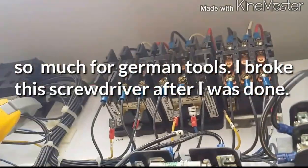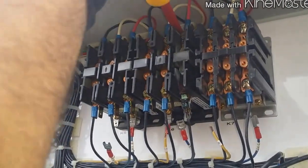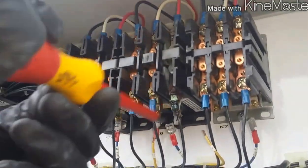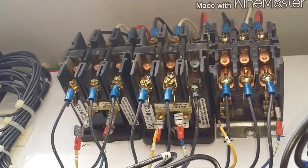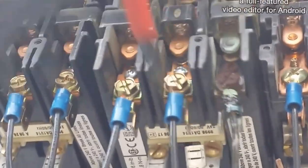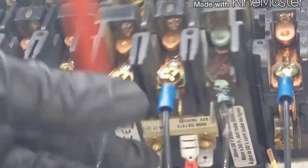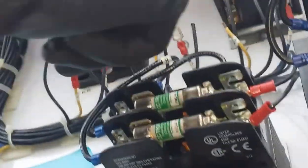I want to make sure everything's off — this is 460 voltage, man. I'm going to shut this off. You know, once I change the contactor I might as well change them for the whole unit. We're putting new fan motors in so they want everything fresh. I did a major repair on this chiller at the beginning of summer, so we're going to change all the contactors because they're old and this one is obviously bad. Take a look at that — we're just going to replace all of them.